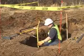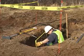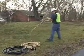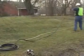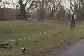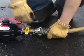The depth of your pit should be approximately 10 times the tool diameter. It should be long enough to keep the service line from kinking. Uncoil the hoses. This will prevent the service line from twisting during operation. Connect the hoses to the oiler, making sure that the couplers are free of debris.